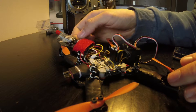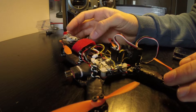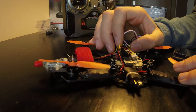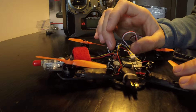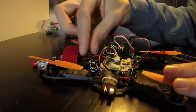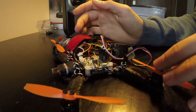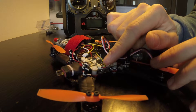One thing to take into consideration: the receiver has to receive 3.3 volts, not the typical 5 volts. On your CC3D, you'll notice there's a little socket next to your motor wires on your left that says 3.3 — that is used to program your chip, but since you're not doing that, you can solder the red wire to the 3.3 volts to provide power to the receiver.